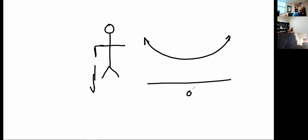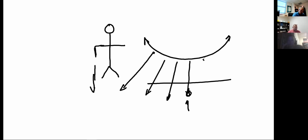Once you start finding the conductor, whatever you're trying to find in the dirt right here at the bottom, get a little bit more precise. That can't be done with arcing the wand, because you're locating way out in these areas when you arc the wand. Does that make common sense?